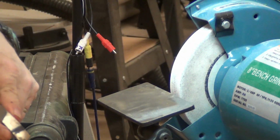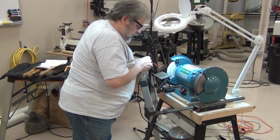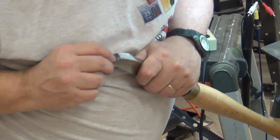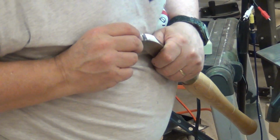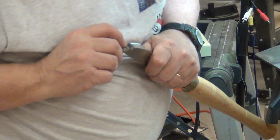See that just took off at the top, so I have to raise the table up. Now let's. So there, it's taking it off at the bottom, and this is really hollow ground, so I'm not going to get the middle part out. So I'm going to call that good because I got the part of the top and part of the bottom.